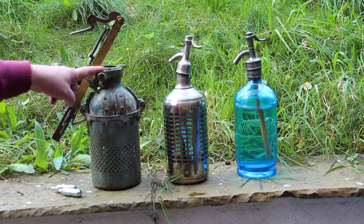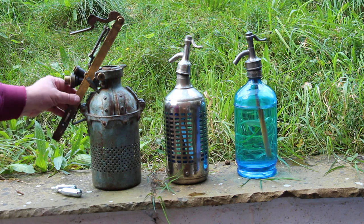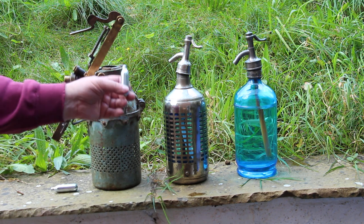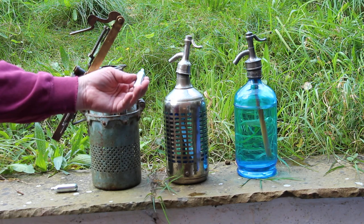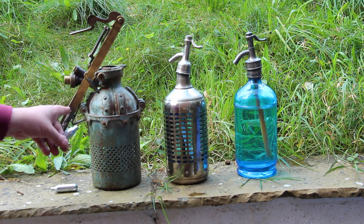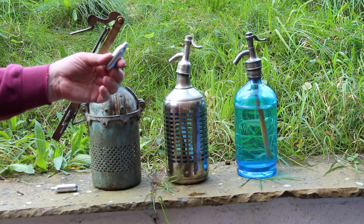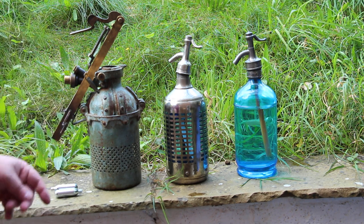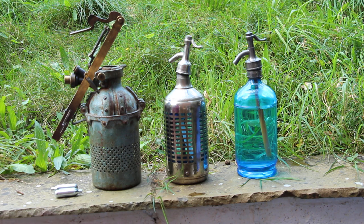This refiller has been partially re-engineered and is still in the process of being re-engineered. We're trying to use as many of the original parts as possible, but it was originally designed for a slightly different — slightly shorter — size of carbon dioxide capsules. These modern capsules are pretty easily available and are standard, used widely in the bar and hotel trade for making soda water with modern siphons. We've had to re-engineer some of the internals and we're 90 to 95% of the way there.